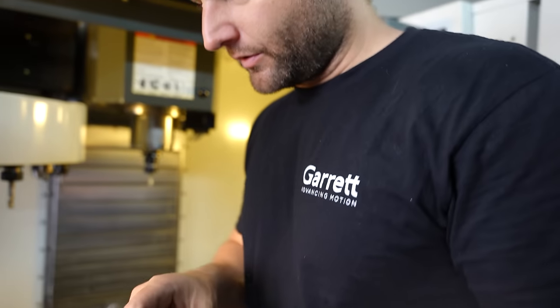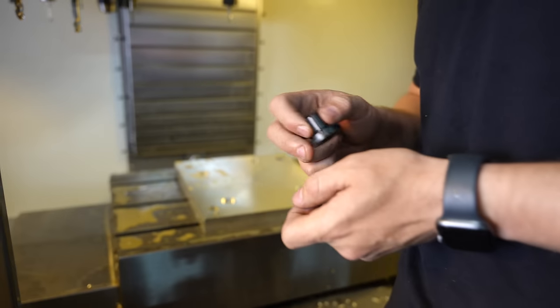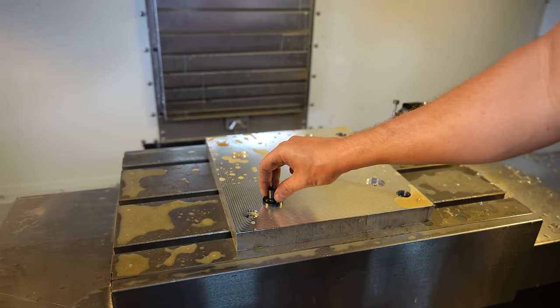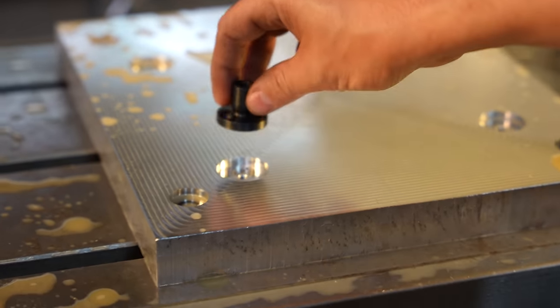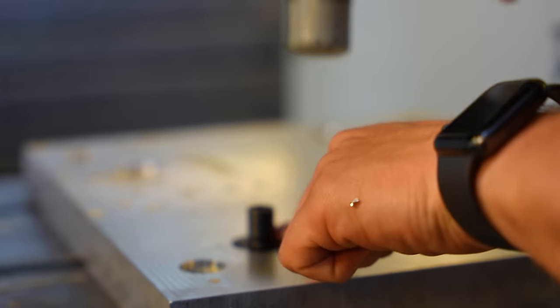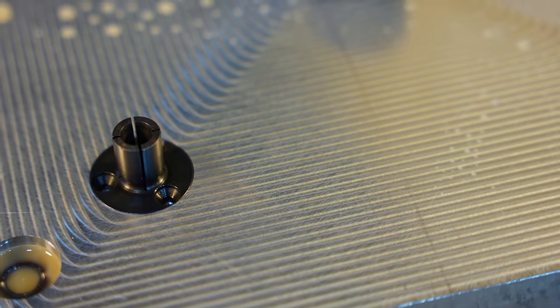So what we are going to do is test this inside of here. Now this is almost a press fit, so I actually took it down 5/1000ths so that I don't put it in there, get it stuck, and it sits too tall. I don't want this steel sticking over the aluminum. In fact, I'd rather have it slightly lower. So we're gonna go ahead and put this in here. So please go in. Man, that is satisfying. Very satisfying. Something's going good.